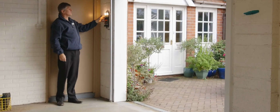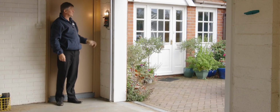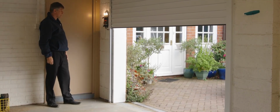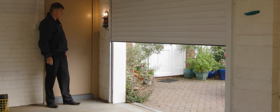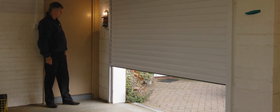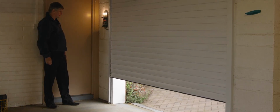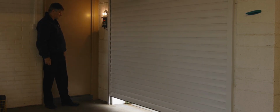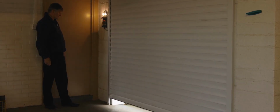To commission, press the RS1 operating button for 1 second, wait 2 seconds and then press the RS1 button again and the door will close. The door should stop just before it touches the floor and then partially reopen, confirming correct setup. Note, do not stop the door during the door close setup cycle. If you make a mistake, simply open the door and repeat the door close procedure.